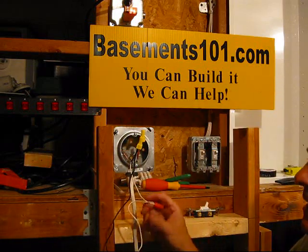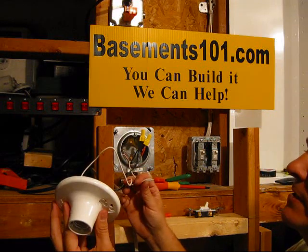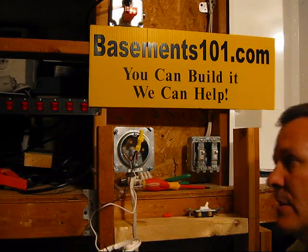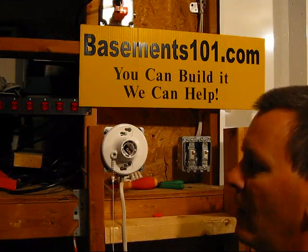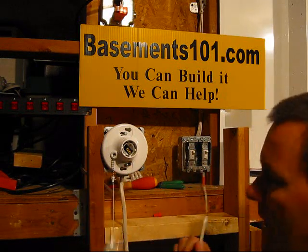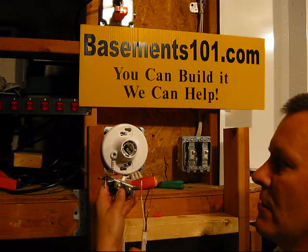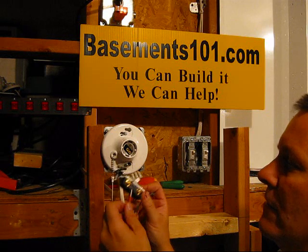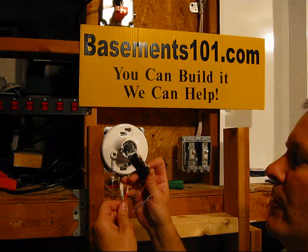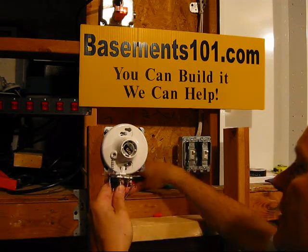Just connect those together. Remember, we didn't touch the white wire going into the light at all. Now we're going to put that all back in the box and then wire the switch up. We've got the light all put back together — now all we need to do is wire up the switch. Normally this would be inside a switch box, but we're going to hook it up outside just to show you the connections. You're going to take the black and your new colored wire — which was the old white one — and connect them both to the two brass terminals on the switch.